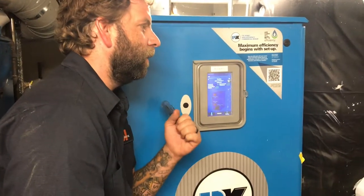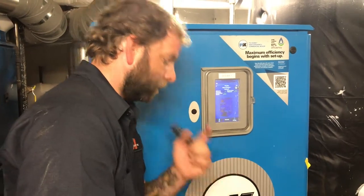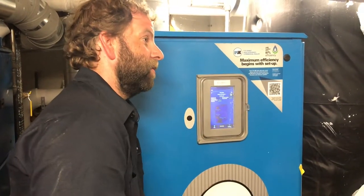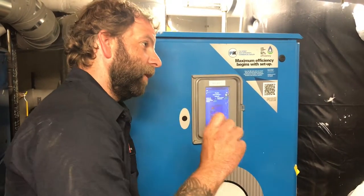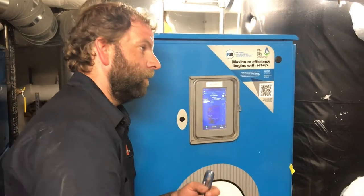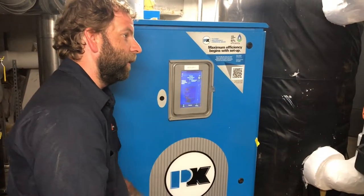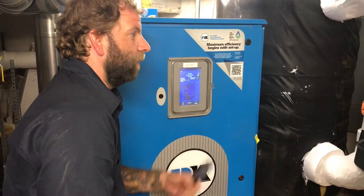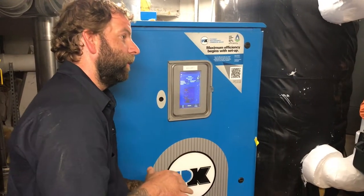These do have low water capabilities. There's an electrode. So if you start getting low water nuisance alarms, that's usually what it is. Isolate your boiler, pull that little electrode out, and again, use some wrap or a light emery or something like that. Just clean it off and stick it back in. Really, that's the only reason why you should ever go into a low water with these boilers, because it is a closed loop, it is a closed system,